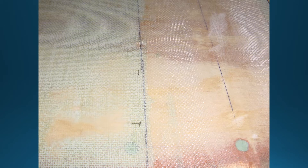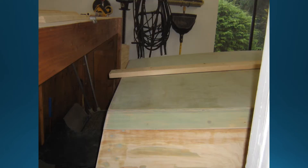Here we are zoomed in on the center line of the boat right here. The keel will be fabricated from a 2x6. Because the keel will cover the center line, I needed reference marks over here about 2 and 3 quarters of an inch from the center line, which is half the width of the keel. The 2x6 I purchased was 14 feet long. Here it is centered and hanging over the back of the boat a bit. Once satisfied with the alignment down the length of the boat, I installed a screw right here near the transom.